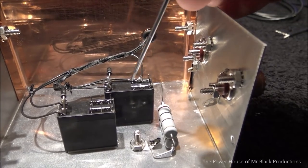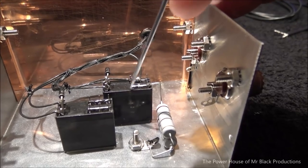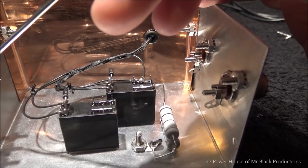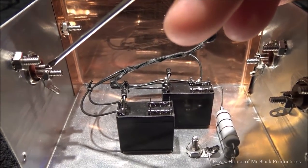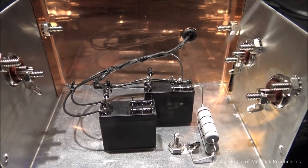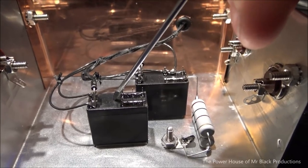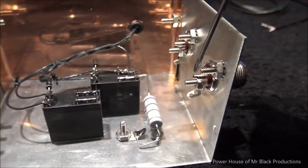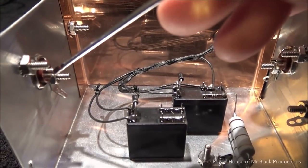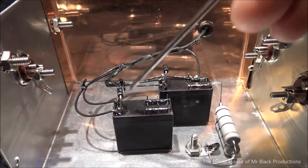we click here. This lead now gets isolated. This lead here is going to be our return lead over to this relay. If we think about it from the RF's point of view, from the antenna, the antenna now is no longer going to be serviceable to this relay connection. This is going to be the relay that we fire last, but it is the one that attaches to the 955. But this is the one that we want to have the RF, or your access to the antenna, see first.